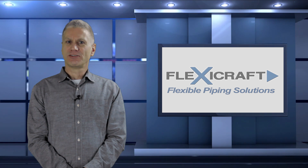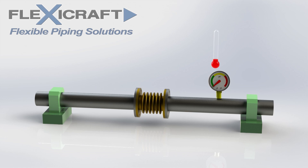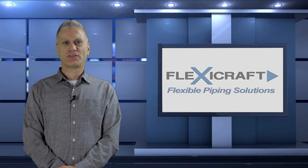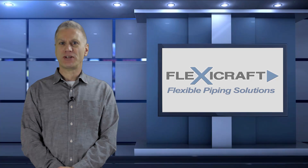So what is the solution to the new pressure thrust load? Well, one solution is to simply ensure the anchors are large enough to withstand it, as we see them getting larger here. Now when the pressure and temperature both rise, the system works as it should. So the anchors must be designed for the force of the thrust load, which is equal to the effective cross-sectional area of the bellows multiplied by the pressure.